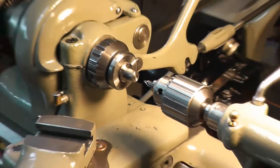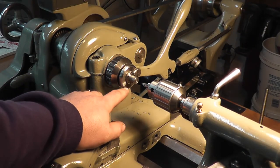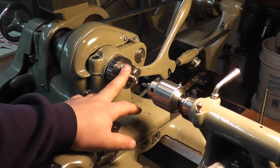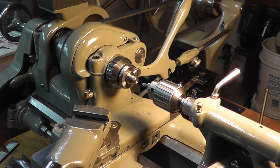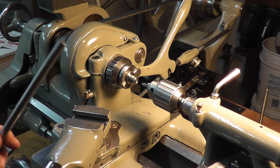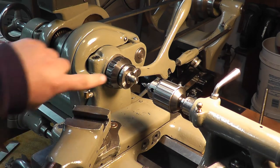By the way, I'm going to do all this operation with a collet setup because we're using half inch and under sizes, so the collet's really convenient for this job here. So the body is going to be made out of 12L14. The pin itself is going to be made from 3/8 air hardening drill rod, and we are going to harden it so that it doesn't wear out. So this has already been faced, so let me send a drill,